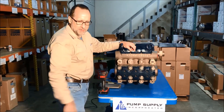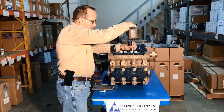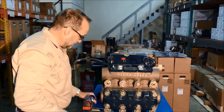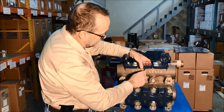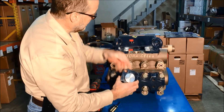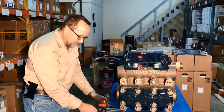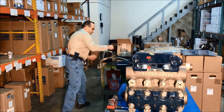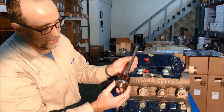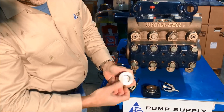I've pretty much loosened these nuts just to make it easier to take apart. First we're going to take out the discharge valve — it's just a series of four bolts here. Then there's a valve that comes out. Wanner did a nice job of making slots on the head so you can pry this out easily. This valve cap has a floating design that the valve guide nests in, and then the valve's inside here. You get a series of tools with the pump that allow you to take it apart. You can insert this tool to extract the valve — it's a spring-loaded valve with a metal housing, a spring, a valve, and a seat.